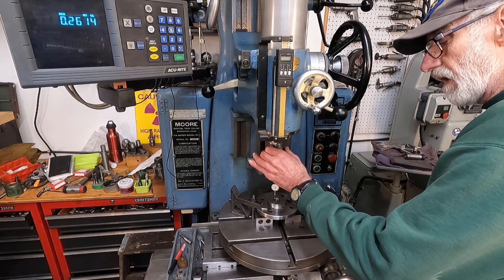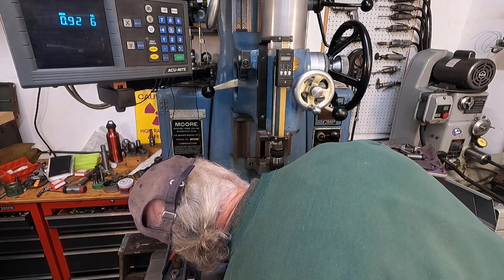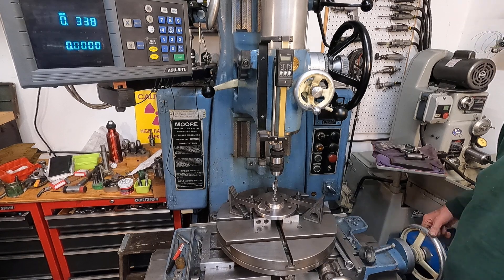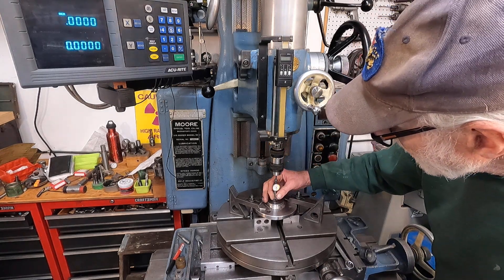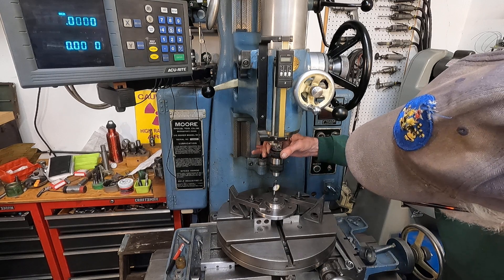I'm going to back this up, turn it 180 degrees, and bring it against that edge. I'll get around here and look. Right there — it's zero. Enter. Now I'm going to put that on zero. Let's have a look at it — I'm going to get it pretty close. That's pretty good. I'll put that against the edge and we'll see how good we're doing. I don't know if you can see that, but that's very good.